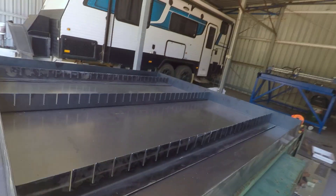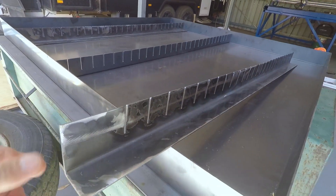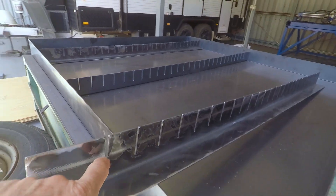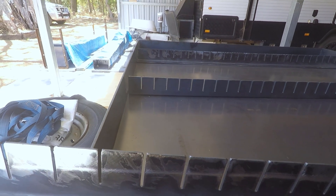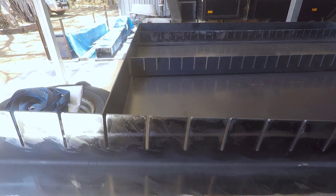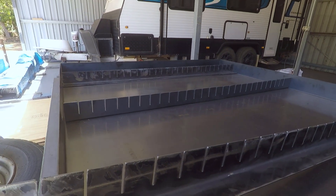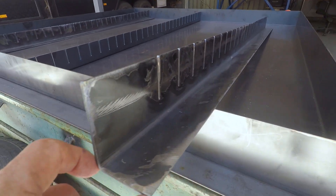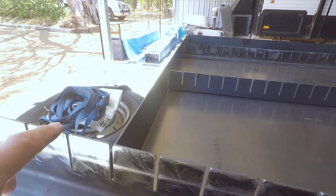There's this 4 inch section to weld up. These are the slat frames — a piece of 3 mil flat that's been cut with a plasma. I'd like to thank Luke from Swags Engineering in Rockingham — he got the sheet for me, cut it, folded it. These are folded out of 3 mil, 50 wide, 75 high, with slots put in every 50 millimeter centers.